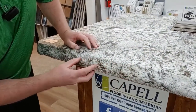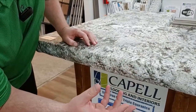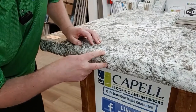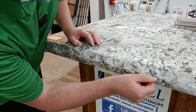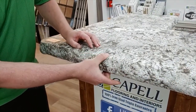When you chisel an edge like this it's kind of just a fun look, something you can do that adds a little bit of character and fun to your counter. In this case we took a 3cm granite and then we laminated the edge, so basically if you look really closely there's a seam in the middle of this, and what that does is it makes your counter look twice as thick.